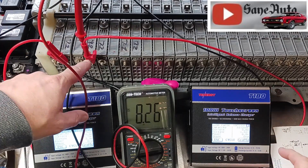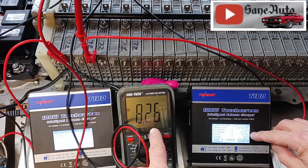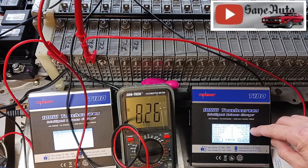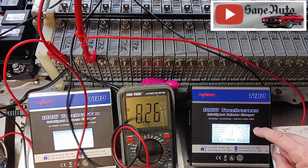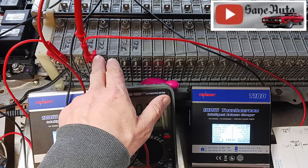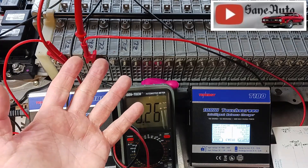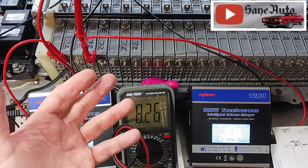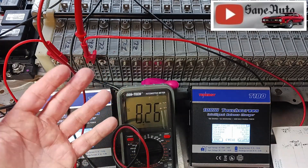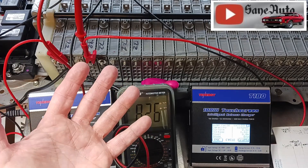Charger A, connected to module D as in dog: final voltage was 8.82, now dropped to 8.26. The final capacity read 8,432 mAh. I prefer to look at the ending capacity of the third cycle discharge, because the real capacity is how many mAh it can discharge back to you. So if it takes 8,000 mAh during charge but can only discharge 5,500 mAh, then its real capacity — in my opinion — is 5,500 mAh.